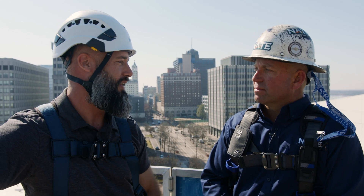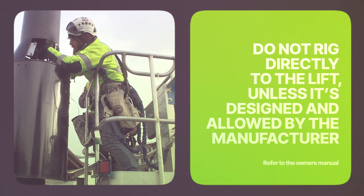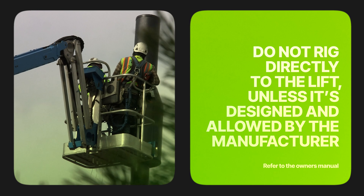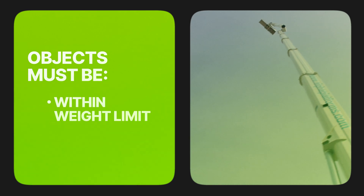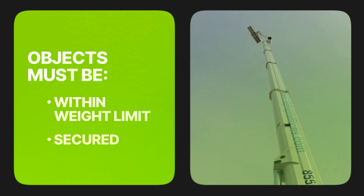That's all great information when working in a man-lift. Sometimes you don't get two chances, and we don't want to find out. What about rigging — is it okay to bring rigging up on the man-lift? We have to be careful not to utilize equipment outside of what it was designed for by the manufacturer. With traditional lifts like JLGs and Genies, we are not allowed to tie anything to the basket itself. Any sort of rigging — tying an anchor or a block to the top handrail to hoist from — is not okay. The basket has a weight limit, and we can use that weight limit to transport material up and down, but it has to be secured. The biggest thing we deal with is dropped objects — always have a secondary tie-off on everything. You've got to protect the customer's equipment, the company's tools and assets, and keep everybody safe on the ground.